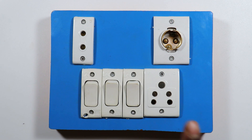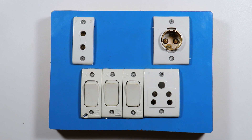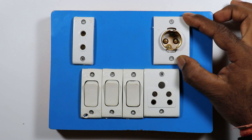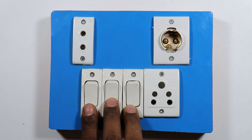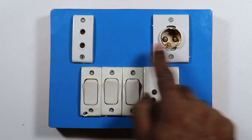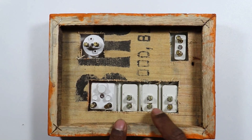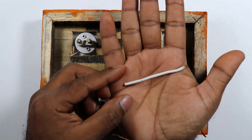To make a series testing board, you need one 3-pin socket and one 2-pin socket. After this, to connect a bulb, we will use a bulb holder. Now to provide power supply to these three, we are going to use 3 switches. Now for wiring of the switches and sockets, first of all, we have to short these switches. To short these, use a piece of wire like this.